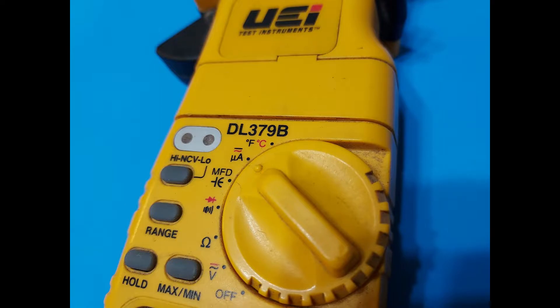The flame sensor is measured in microamps. You can see the meter on the screen here — it's got that little UA, that's the microamp setting, and that's where you'll read the microamps. Typically the microamps will be between 3 and 4. If you're down to 1, most likely you need to pull it off, get it cleaned up, and reinstall it.